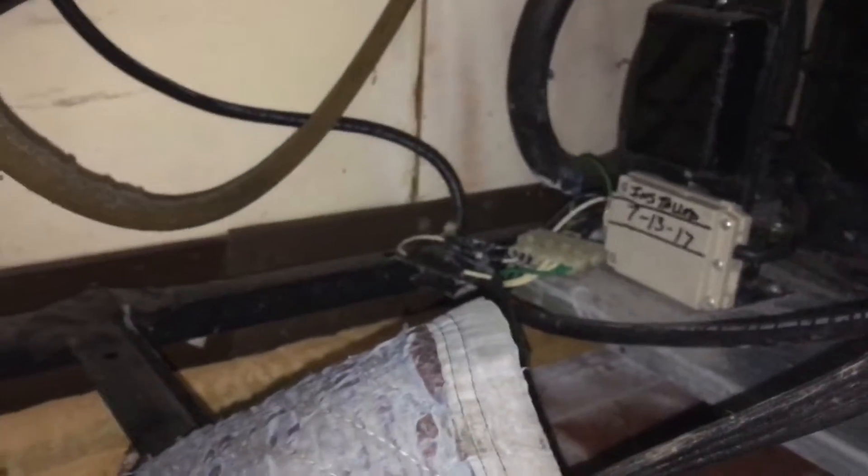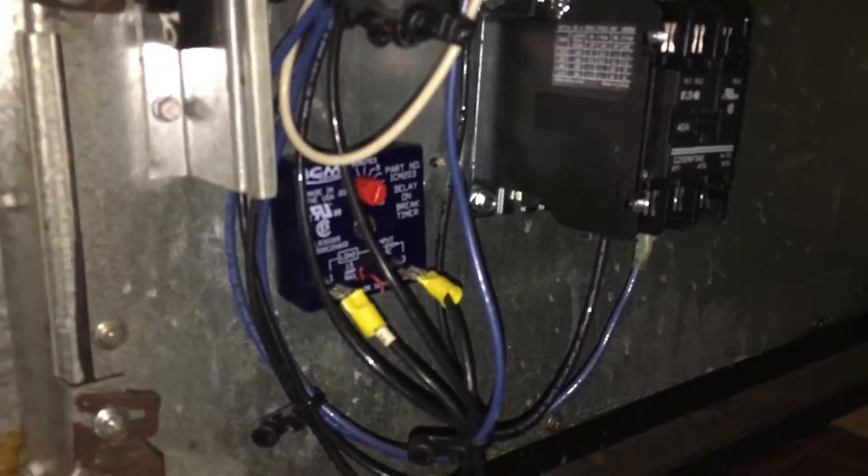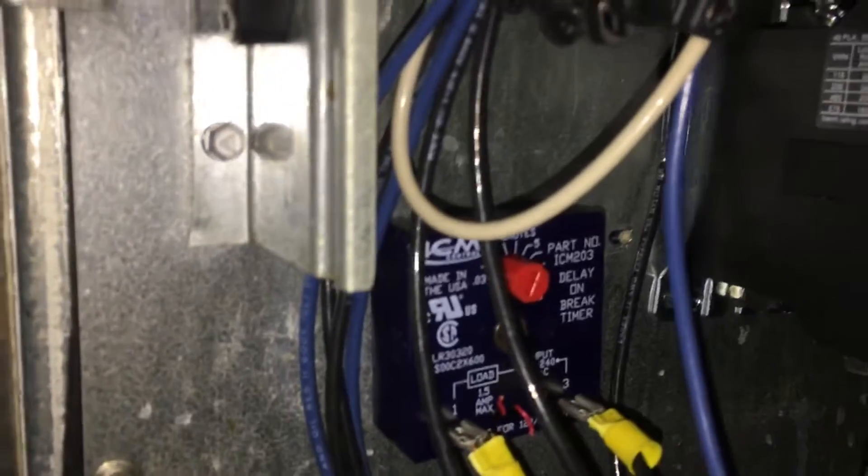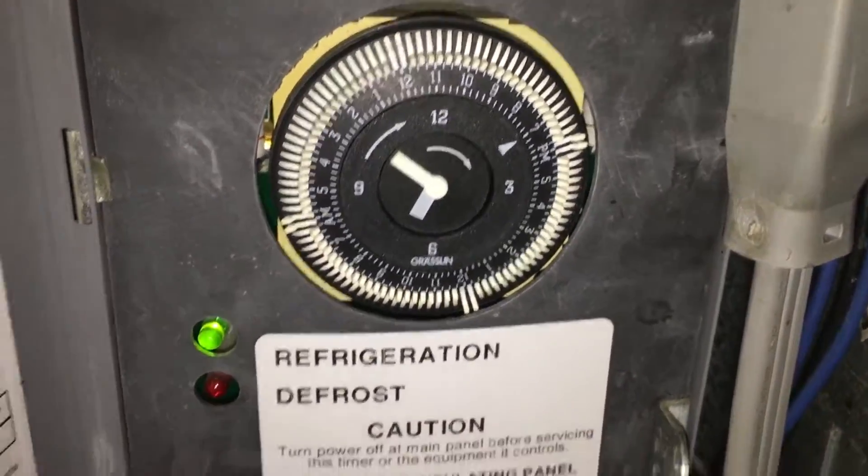That's why my new deal is to put a time delay on these things now, because having the compressor come on in 30 seconds is bullshit — that's why these wires melt in the back there, where the plug and stuff is. If you've got T-49s or T-72s or anything, put a contactor and get rid of that little cheapo relay — especially for those one-horse compressors on the T-72s and the semi-hermetics. Put a time delay on it. I use a delay on break, so if the unit has been off for five minutes already, it won't stay off for another five. That's where we're going.